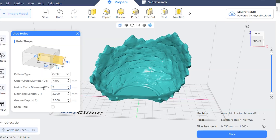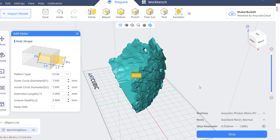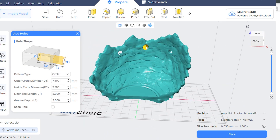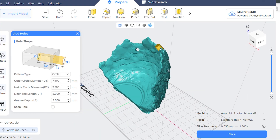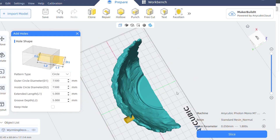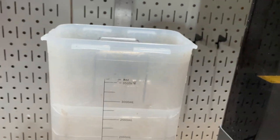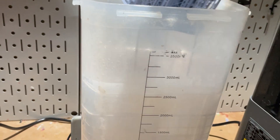For the channels for the LEDs and photoresistor, I used the Anycubic slicer to make the holes. I made the holes 7mm — most LEDs are around 6mm. I always make the holes slightly larger as it makes assembly of electronics easier. Let's get the rest of this model printed and prepped.